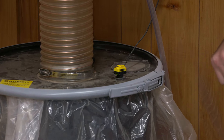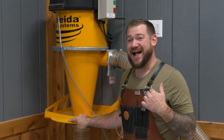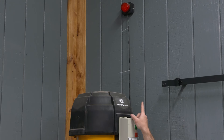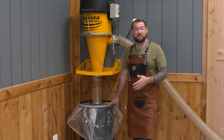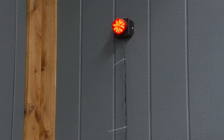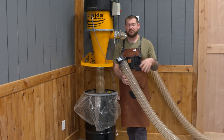There are a couple of other features I really like about the Supercell. First is the integrated remote with a magnetic controller, so no matter where I am in this 1,600 square foot shop I can turn the Supercell on or off remotely. The other feature is the light up top, which is tied to a distance sensor on the collection barrel. Once the dust and debris in the barrel get high enough, the sensor triggers and the light starts blinking — letting me know it's time to empty it and put a new bag in. I also have 100 feet of flex hose attached, and with all that resistance most dust collectors wouldn't handle it, but the Supercell has no problem.